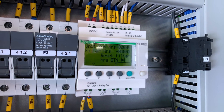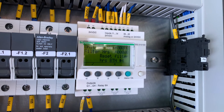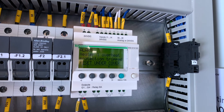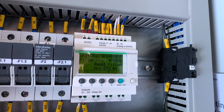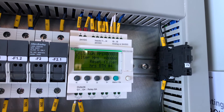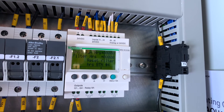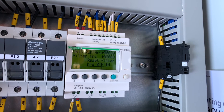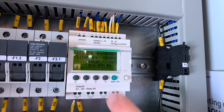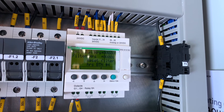In the event of a heater trip, you'll see a message on the display that tells you what the problem is and how to rectify it. You'll also notice the display has a timer — a counter of hours. At the top is the unit run hours, which is cumulative and will just keep counting up. Whereas the filter hours you can reset by pressing button four here, so anytime you do a filter change, you can reset the hours to see how many hours you get on each set of filters.